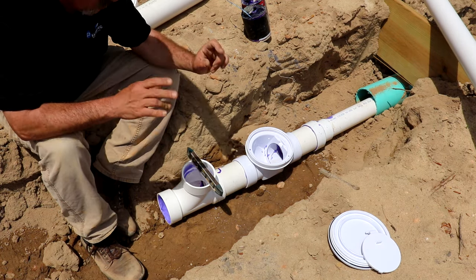Well, I'm gonna have to go back up the way here and bed this thing down and check the grade on it as I go. I know I'm falling, but I got a little belly up there because I lifted this up a little bit, but I got plenty of fall. This is normally a 2 to 3 person job, but I think I did all right by myself.